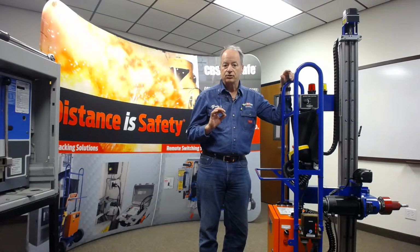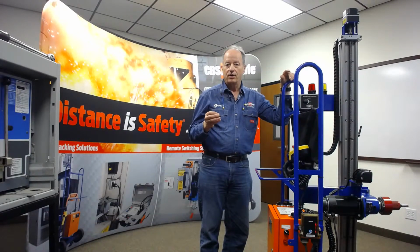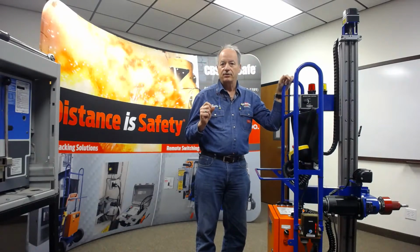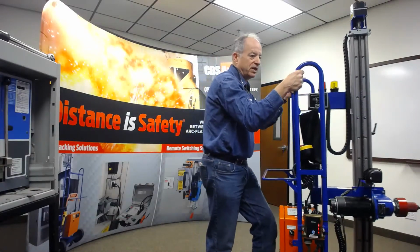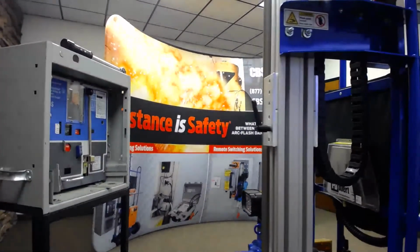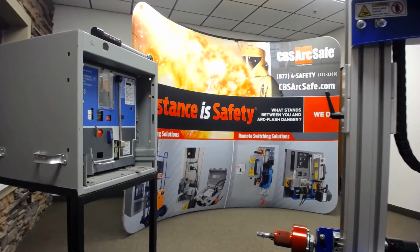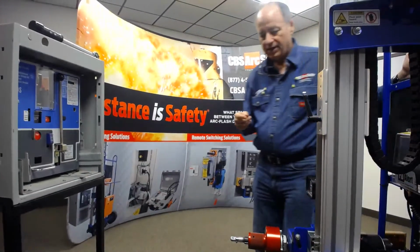So that's one of the things to make sure you understand, and we've had customers give us feedback that they've told us, yes, when we found a breaker where it took more to take one out than to go in, you're right, there was a problem in the cubicle, we were able to get it fixed, okay? Because up until this time, you're just depending upon one person's arm compared to another to give you feedback as far as whether or not you think you've got a problem. With the RRS-1, we can actually read out what the forces are that are being used to rack the breaker. And that has been a great benefit for many customers to help them identify and actually start tracking maintenance on cubicles.